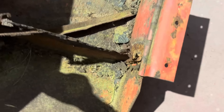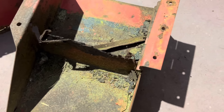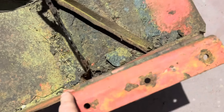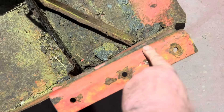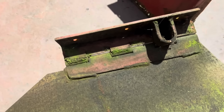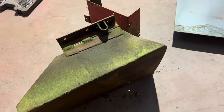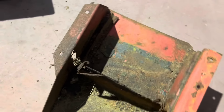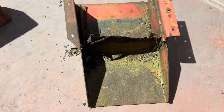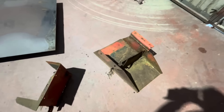And then there's the top one again, not looking the best. So we're gonna have to extract the hinge, get that unseized with the help of Mr. Gas Torch to save that bit. We have a sheet of steel there. I can do a lot of careful measuring and folding to recreate a new one of those. I haven't made them before but as you can see...